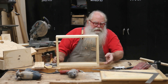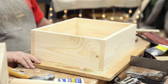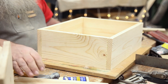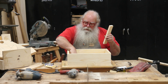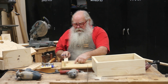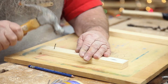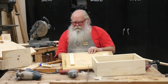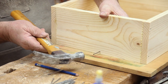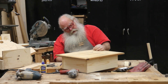Now we need a base. If you make it so that the base extends past the frame, then you can put your clamps outside of the frame — you can clamp it here, over here, or over there. I'm going to go ahead and put the base on, and to secure that I'm going to put a piece along the front and a piece along the back. I made a mark here on the inside edge where I'm going to put it. I'll bend it over carefully — if I went in any further it would go into my table.